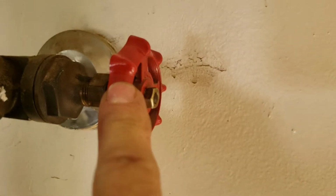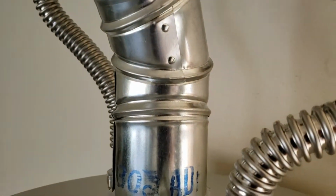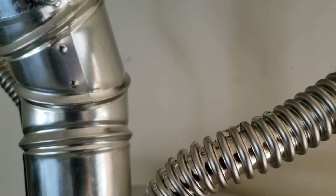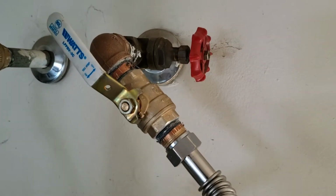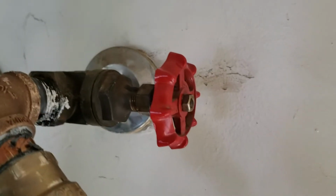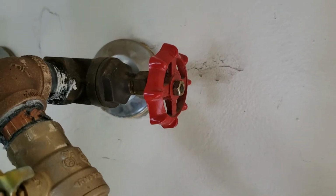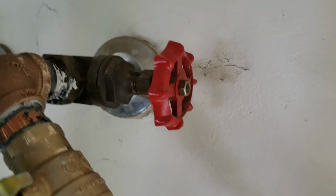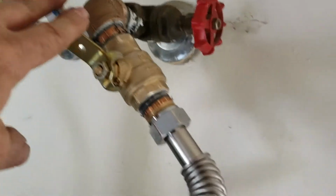And the reason why we couldn't take it out is this subdivision. They ran water lines to all of the different townhomes and didn't put a shutoff valve for the water out front. So there's no way to shut it off without shutting everybody else off. If you have trouble with this valve, then you'll have to coordinate with the HOA or whoever is involved out here to shut down the units, and then come out, demo back that valve, and get everything put back in place. So we did install a brand new valve as per contract.